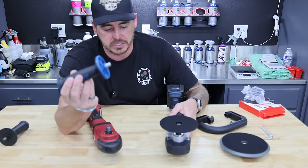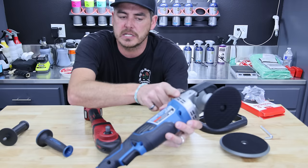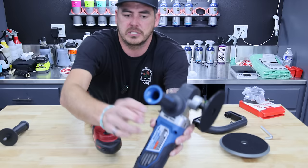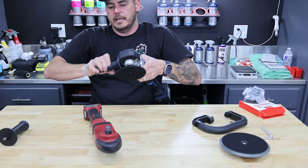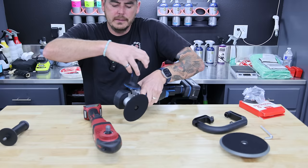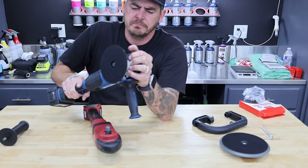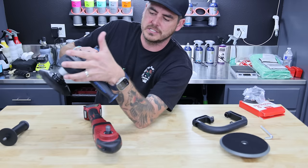I'll note there is a vent at the head and when you're running this thing the heat dissipates through that, which is very nice. However, if you have the handle on this side it will block that a little bit, causing the machine to heat up faster than it would otherwise. The vent is now back behind and being blocked by that handle. For me personally, I run the handle on the other side, and many times I don't run a handle at all, at least with dual-action polishers. With the rotary though, the head does tend to get hotter and doesn't fit my hand super well, so I do like having the side handle for extra support.